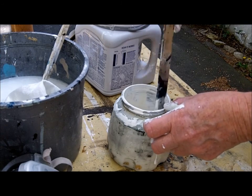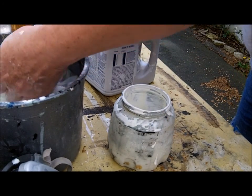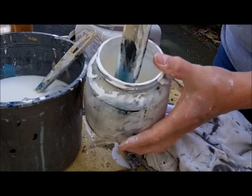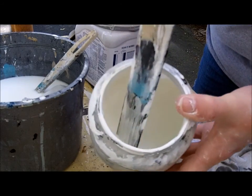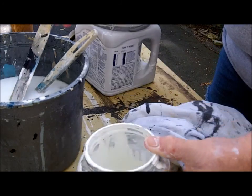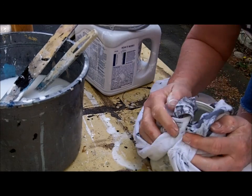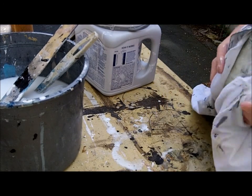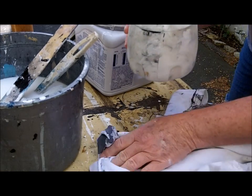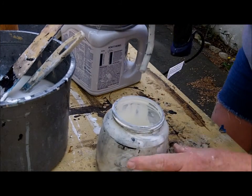I think that's going to work really well for this paint. The reason I can't give you an exact ratio proportion is because paint is different — every brand of paint is different. Some paints are thick, some paints are thin. Can you get a feel for the consistency? It's pretty thin. Think about that can of spray paint you buy — it's pretty thin inside that can and you shake and shake to mix it all up. That's why I base my consistency on that, because it is a fine finish. So that was about a three-to-one ratio.